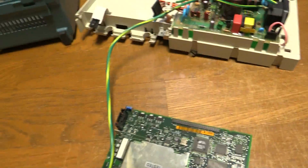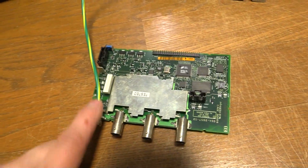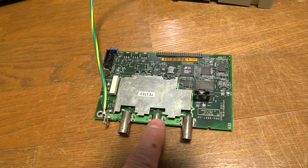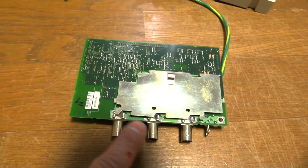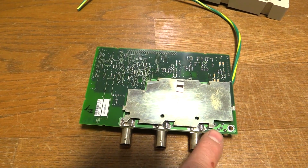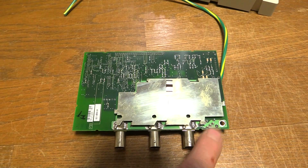And if it does, it's not worth sending it in. Just do this mod with the earth wire — you can solder it pretty much anywhere along here, to the actual bodies of these, to this ring here, or even on the back. You can solder it anywhere along here. If you have a close look, you'll see where the ground plane is. Just be careful — you've got your five volt square wave calibration pin here for your probe, so make sure you don't cause any solder bridges onto that.